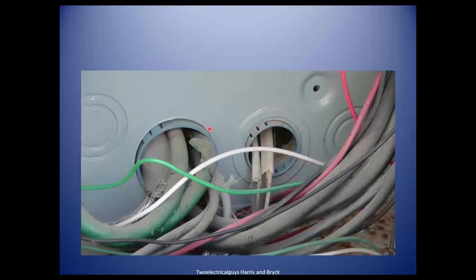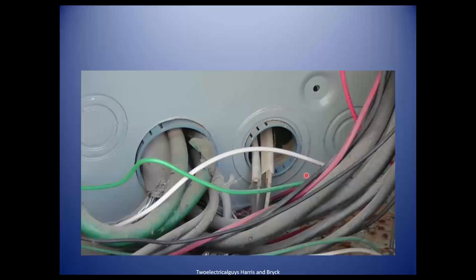When I have a knockout in a panel, am I required to have some sort of ring or bushing? Yes, that's called a plastic bushing. This looks like part of a telephone system — these are fuses. How many volts run through this when the line rings? It's 120 volts when it rings, but 48 volts most of the time otherwise. That's why when it would ring and you're touching a bare wire, you'd get a pretty good shock.